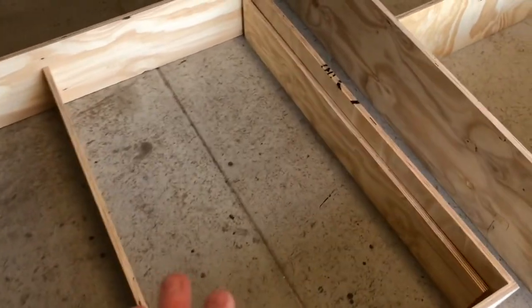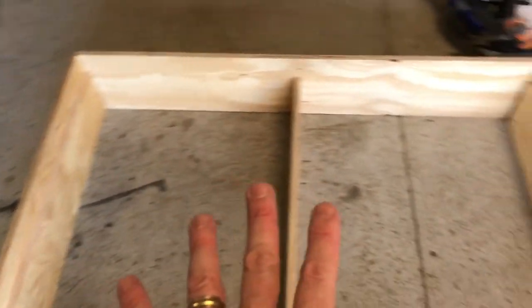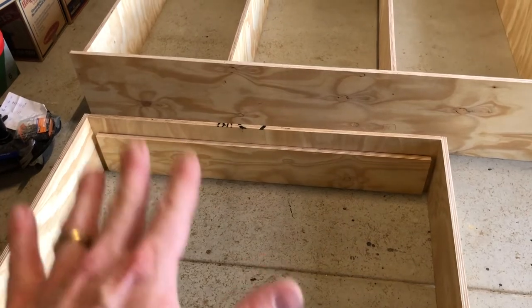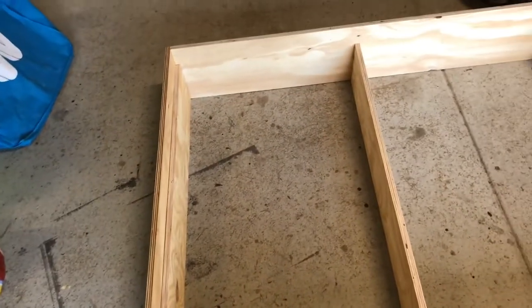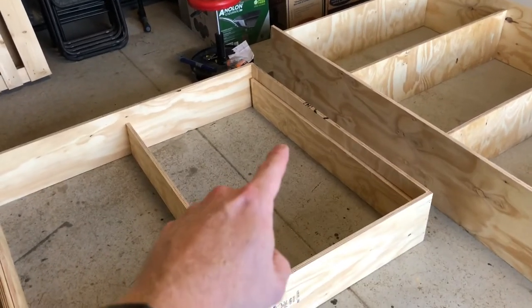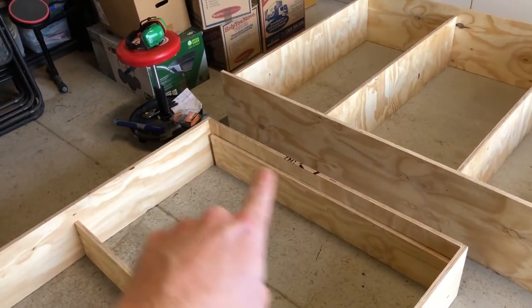For the inside of the putting green I'm going to put some extra pieces for strengthening beams across here, and that'll allow the plate to sit on top and on the base. It's a little bit short, but I had this extra piece left over at the right height — you'll never see it once the top panel is down, so I'll screw and nail that in with some glue. I'll get some brackets to attach to the outside so we can hook it on, then cut the three holes in the two joined pieces and into the main piece where the pipe will come through and the balls will come out each side.